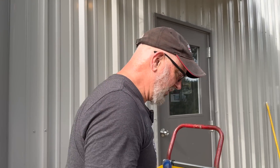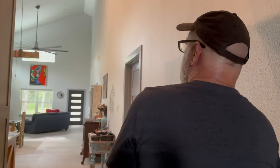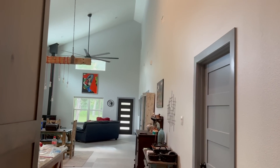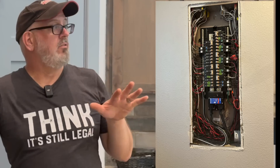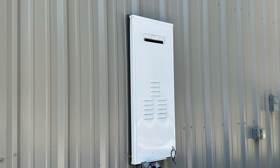Let's go in and check what the house looks like running off our solar-powered battery backup. Lights on, fans on — great, we're running off solar power. We harvested the solar power from the panels, put it into the battery, and right now it's running strictly off the battery. We can also hook up the solar panels while the sun's out to gain more power and charge the battery simultaneously. The 10 critical load circuits mainly consist of lights and plugs in each bedroom and room, plus an on-demand propane hot water heater that uses a very small amount of electricity.